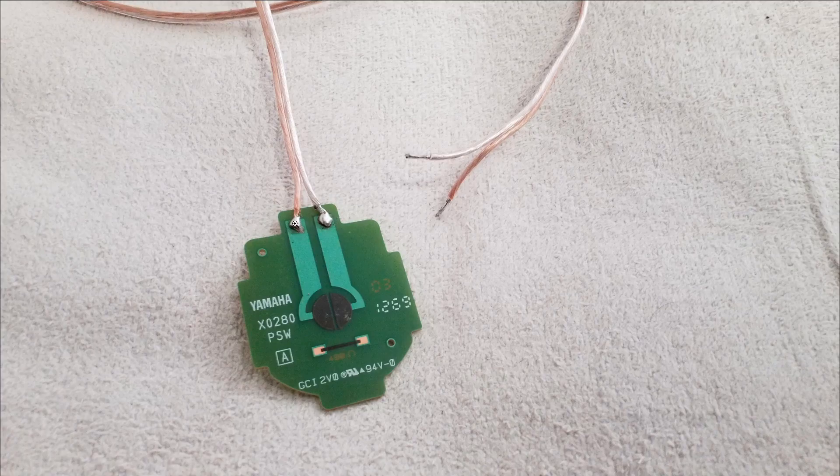After using the soldering iron to remove the old wire and solder on the new, I split the two conductors apart a little bit and soldered them on, doing the same on the other end. I also tinned them — these ends are just exposed copper stranded wire, but I rubbed them with solder so they're nice and solid. They don't fray, and you can just shove them into a screw terminal.